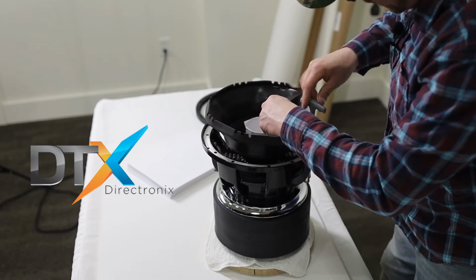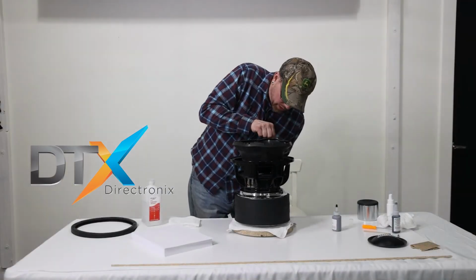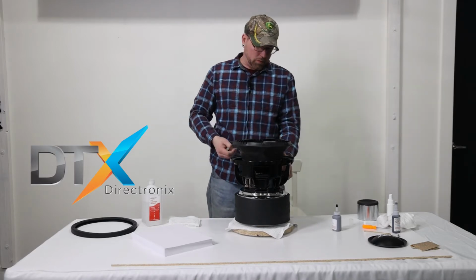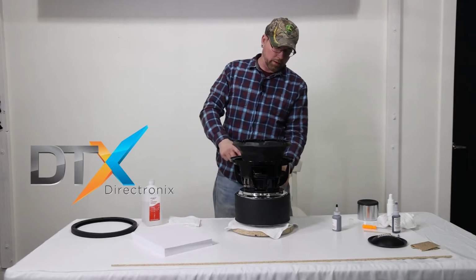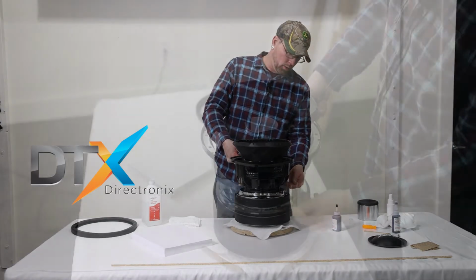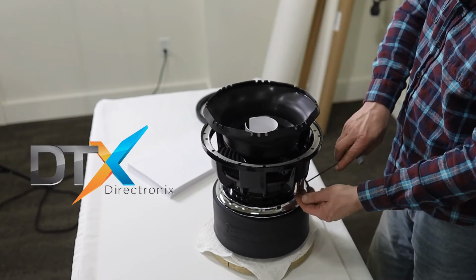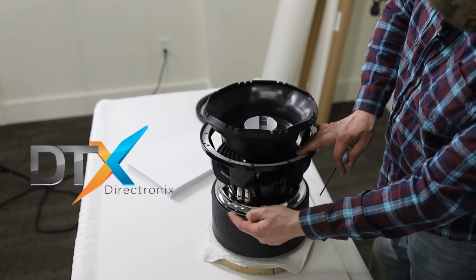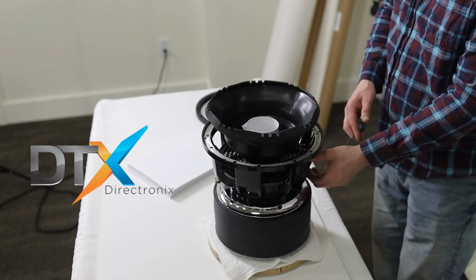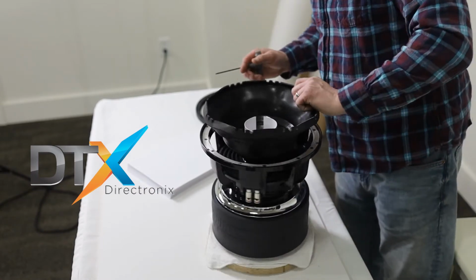Suppose another thing we can address during this situation, I get asked a lot, which side is which on terminals and subs. Best bet would be to have a 9-volt battery. Go positive, negative, pop test up. Obviously you would have your positive correct if it's popping up when you touch it. But generally, positive would be this guy here. He's definitely on the left side normally. This depends on the polarity of the speaker, so most are this way.